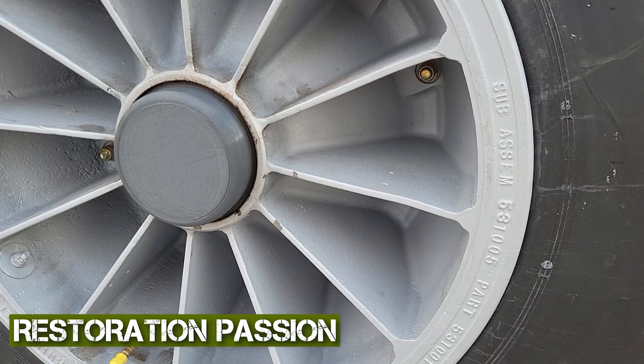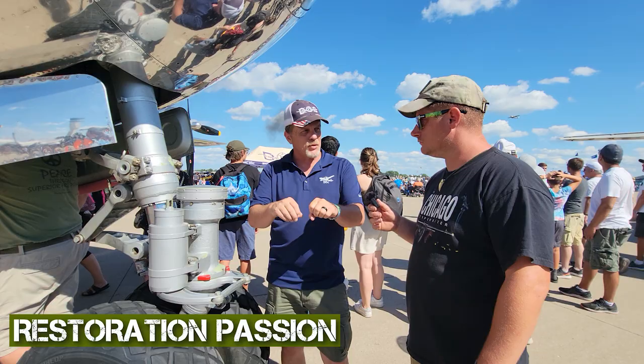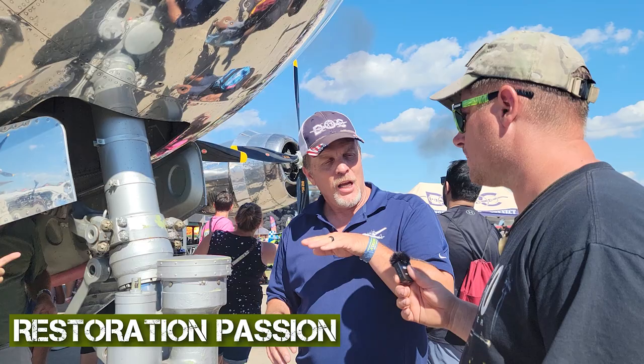And even on takeoff roll, what will normally happen is the pilots will get us out there, I'll do the run up, we'll get staged, they get the airplane lined up and set the brakes. I'll set initial takeoff power, and they'll take over the throttles and work up the number one and four throttles to get this thing steered down the runway until it's going fast enough for them to use the rudder. Then they'll call the throttles back to me, and I'll take over.